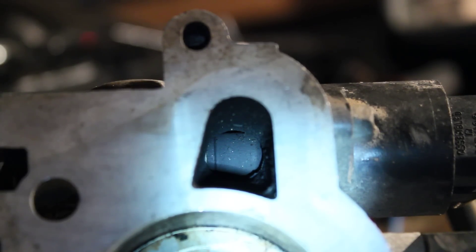I actually found I swapped the polarity on one of the two coils. Basically you can swap either one — so if you think you've got it right, you ohm it out. I got 50 ohms or 60 ohms on each coil; that's how you can tell which coil is which. And if it doesn't work after that, you just swap the polarity on one coil and it should be good to go.